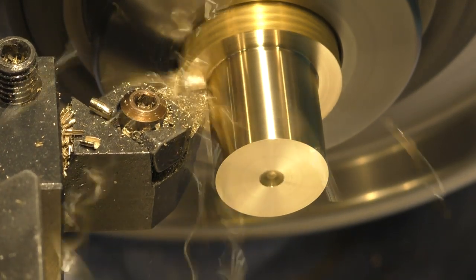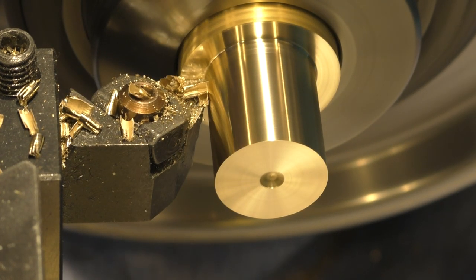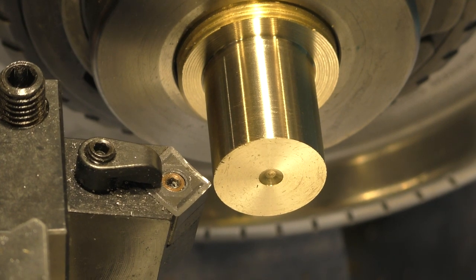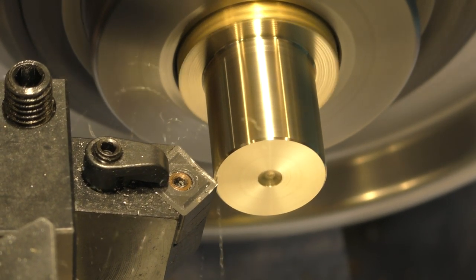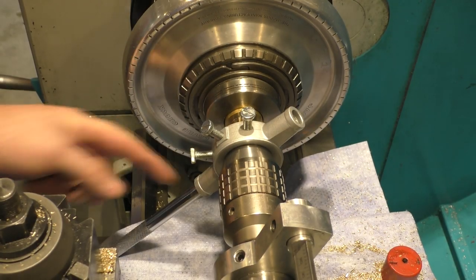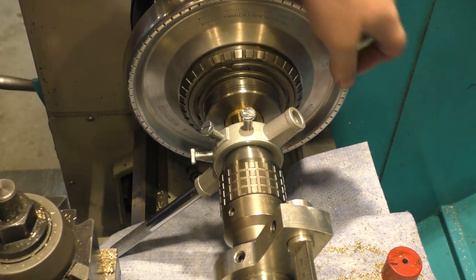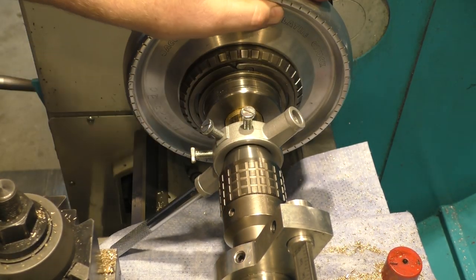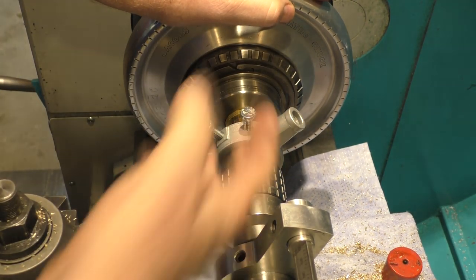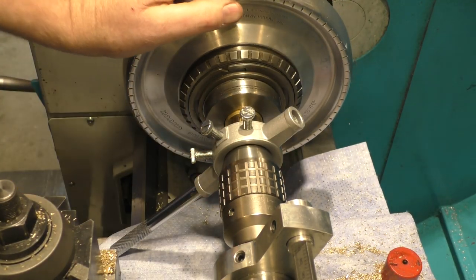It's about to take half an inch at a time. Not having any problem. That's kind of amusing. To help get this guy started, we're going to chamfer it so we can get the die started on it. That'll give a nice lead in. Got one arm here that's resting on the base down here, and I'm just using the chuck to draw this guy in, using my drill chuck with the jaws pulled all the way back in to keep it centered, and that's it.